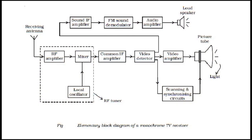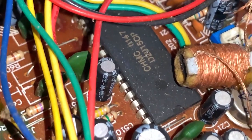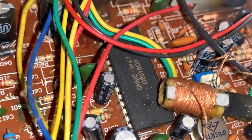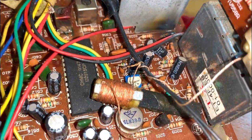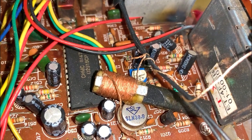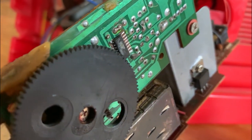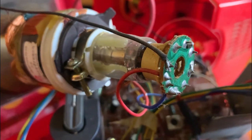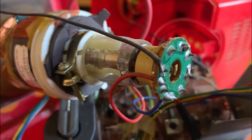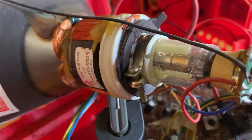Monochrome CRT TV, also known as black and white TV, is capable of displaying only shades of gray. It uses a single electron gun to fire electrons at a phosphorescent screen coated with a substance that emits light when struck by electrons. The screen is divided into millions of tiny pixels, but they can only emit varying intensity of white light. By controlling the intensity of the electron beam, different shades of gray are achieved, which create the illusion of an image in black and white.